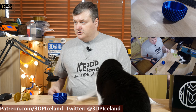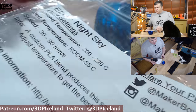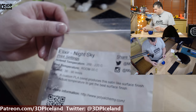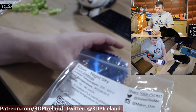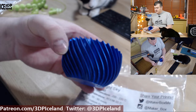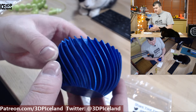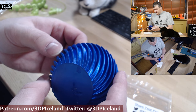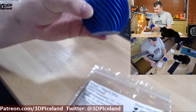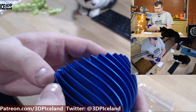The first filament I want to show you is the Elixir Night Sky from Polyalchemy. This filament is one of my favorites — I have three colors already from Polyalchemy and already have a roll of this. I decided to just make one print with this filament, a small spiral vase-like ball. I've printed several things with this Polyalchemy filament and it always looks excellent and is really easy to print with. I usually print it at 215 or 220 degrees.